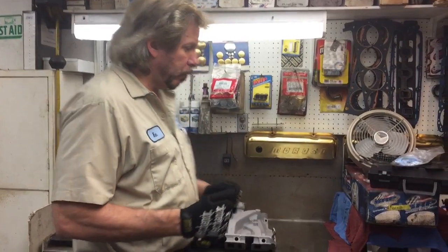Sandblasting is a big mistake for most people because the sand is really difficult to get out of items. It gets up inside little crevices, where things are joined, pop-riveted, or welded, or inside water jackets. It's extremely difficult to get anything cleaned with abrasive media back to the condition it's supposed to be with all that debris removed. We can do it here because we have proper industrial-grade cleaning equipment — not a garden hose or a household sink.